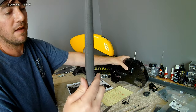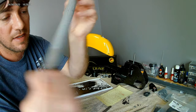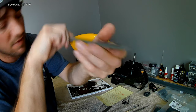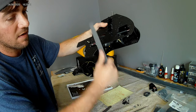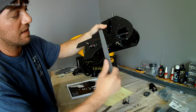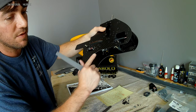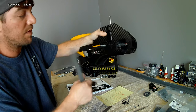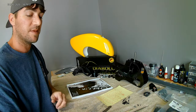When you're filing the curved portion of the frame, I used a half-round file — as you can see, it's got a curve on it. That allows you to get that curve very nicely and easily, and you won't cut sharp spots. When you go around the corners with a flat file you can potentially cut flat spots, so if you have a half-round file I recommend you use it.